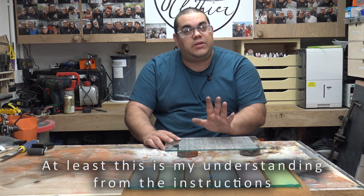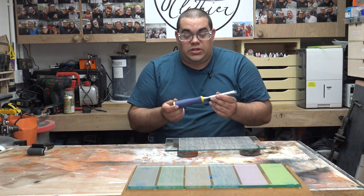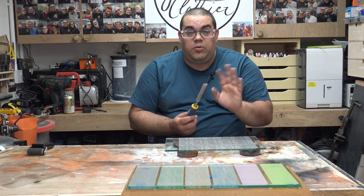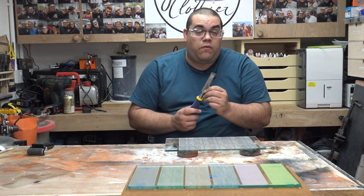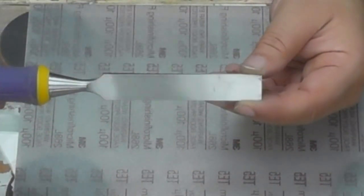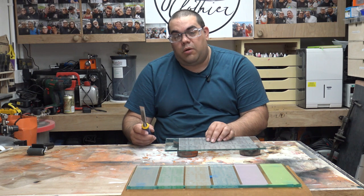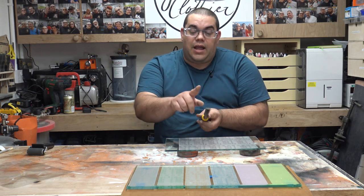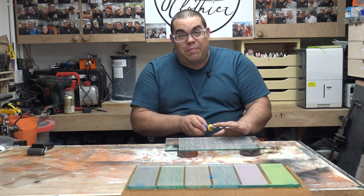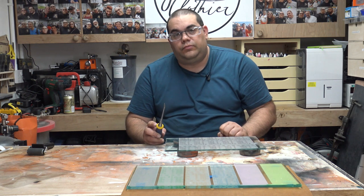The reason we put this on a different sheet is because the 100 micron isn't really used for sharpening — it's used to put the initial shape on. This chisel I'm going to use is fresh-ish out of the packet. It's been used once to fit a lock on the shed door, but I've done nothing with it as far as sharpening is concerned. You can still see the grinding marks from the grinding wheel. The two things you want to do when sharpening are: get a nice polished edge on the back and a nice polished bevel edge — and the two polished edges coming together is what makes it sharp. So first we do the back on the 100 micron, then put a micro bevel on the other side.